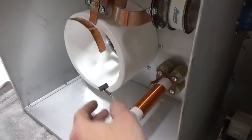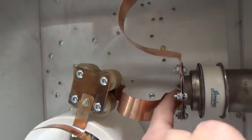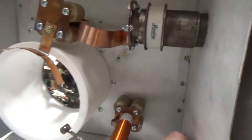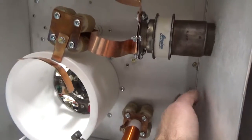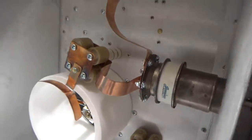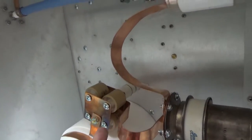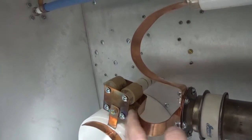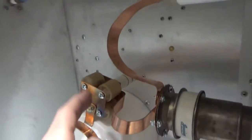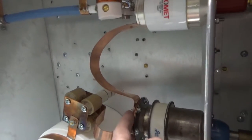You have the anode B-positive connection. After these are trimmed, they'll both be soldered to this copper piece I cut right here. I added the right-angle aluminum at the base to give a better electrical connection path between the plate tune vacuum variable and the tube grids. I have four 15 kV doorknob caps in parallel. I'll manipulate this to bring it away from ground so it's not adding any more capacitance to the plate tune vacuum variable capacitor.